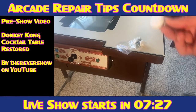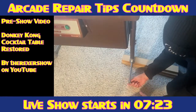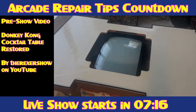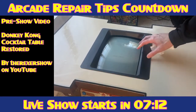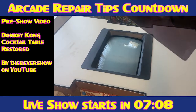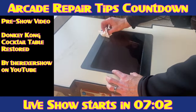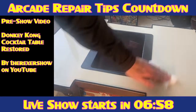After getting the top on, I would replace the feet that go on the legs of the cocktail cabinet. These are specific to Nintendo cocktail cabinets, and I purchased them from Mike's Arcade. I'd then add the plastic bezel that goes around the monitor, and then put in place the tinted plexiglass. This actually is great. It hides a lot of the burn-in and actually makes the monitor look excellent.